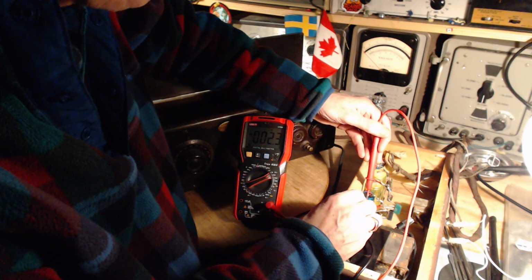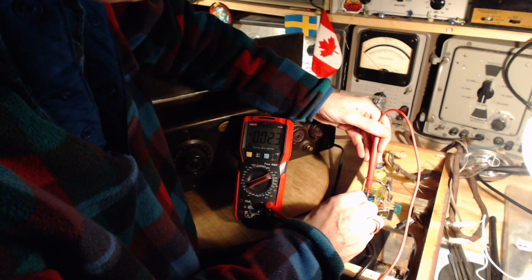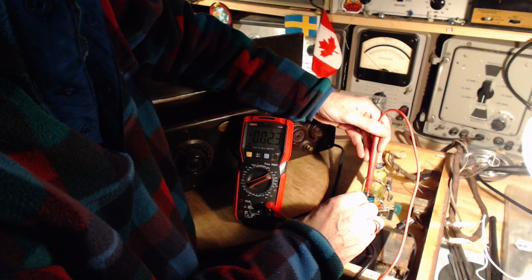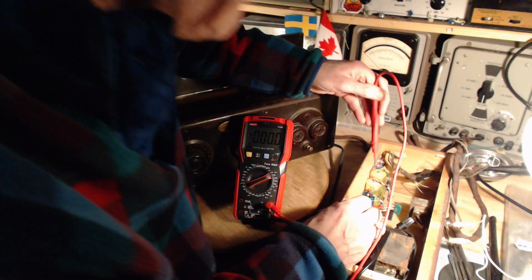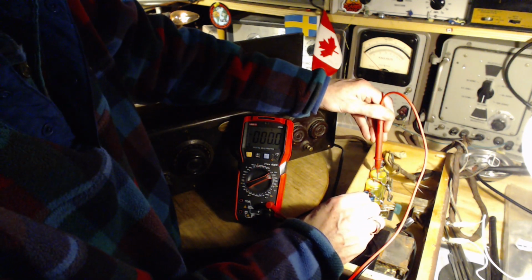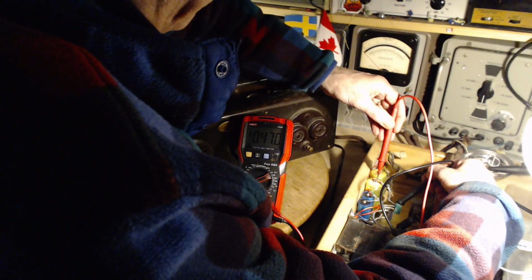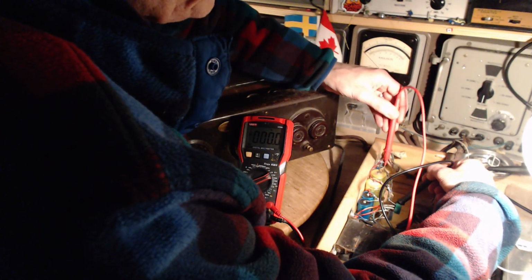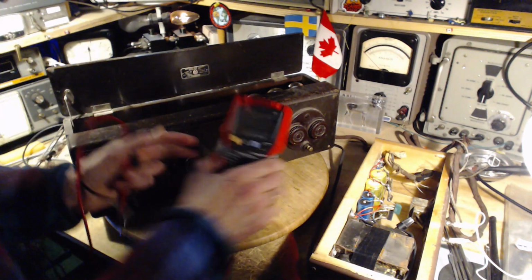So there needs to be a supply in here that's going to supply the heater current. This is probably it. He's probably arranged a DC supply using the same ground. Can I read this? Nothing's showing up at all. Okay, using what is probably the ground for these. There we are. 70 volts, so 35, so very good, 70 volts.